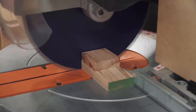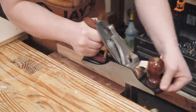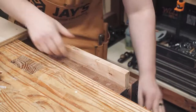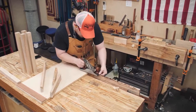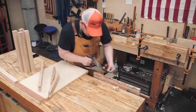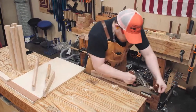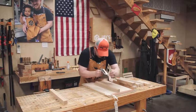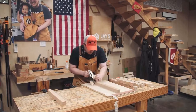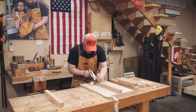Then it's back to the miter saw to cut the pieces to their final length. I ripped the pieces a little bit wider than the final width because I knew the table saw would cause some burning on the maple. Maple and cherry are notorious for burning easily against woodworking tools, but with a few passes of a hand plane all of the burn marks are completely gone — and not only that, but all of the machine marks from the planer and table saw are gone as well. A smoothing plane is much faster than sandpaper for material prep like this, assuming the wood grain isn't going in multiple different directions.